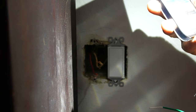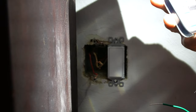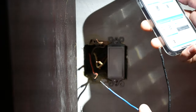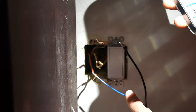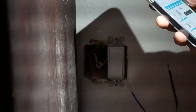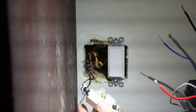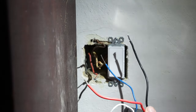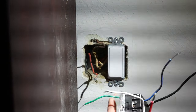The noted wire that goes to the different-colored screw is going to connect to the blue wire on the Caseta. That red wire is the one we're going to connect on the same side as the different-colored screw. I'm going to pull the other switch open just to see how I have it wired so I don't have to rewire that side, and then we'll get this wired up.